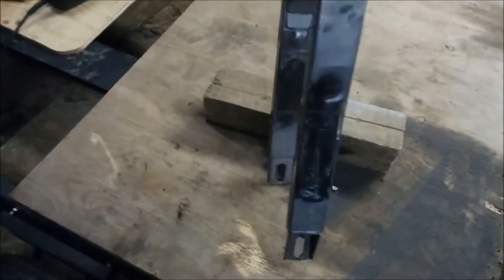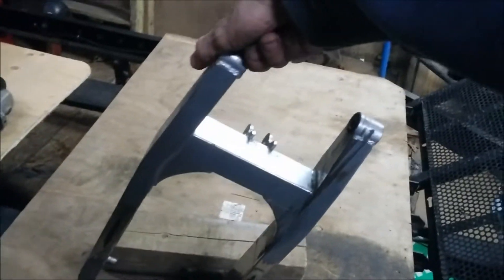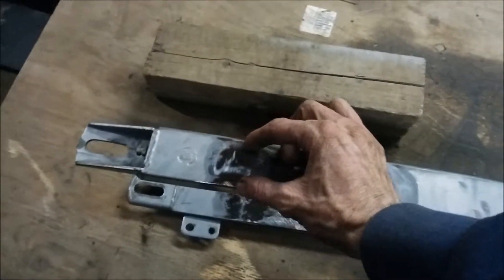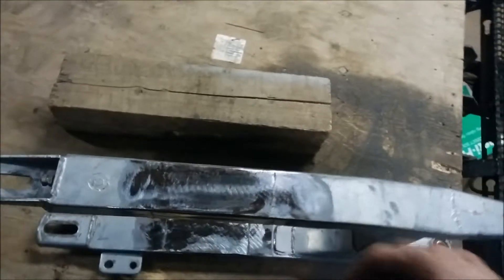This has to face down. Came out not too bad, not too bad at all. So now we're just going to weld the gussets in on there. I had to grind it down before I could weld the gussets on - it's got to be nice and smooth. And we're going to fully weld them all the way around, all four sides for strength.